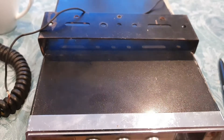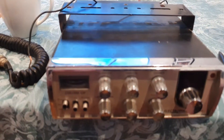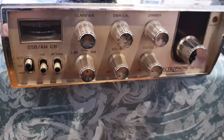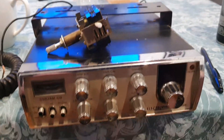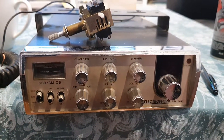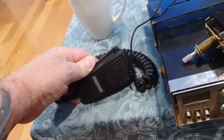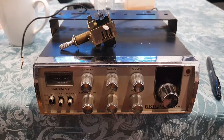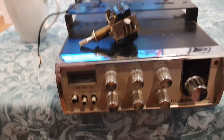Just prior to that I'll give both covers a light sand with 2500 grit paper. Stage two of this series will be fitting a 40-channel block to the 18-channel radio, and whilst I'm doing that all the knobs and fascia will be in the soaking bath to remove the yellowing and general use over the years. The microphone will be done another time. For today, the radio works as it should — it'll need a minor tune but the plan is to start the ball rolling.